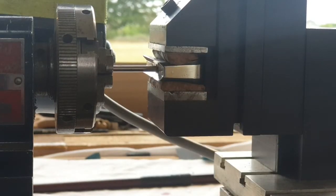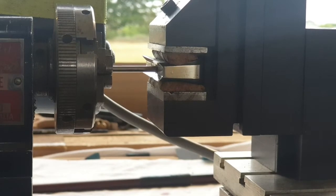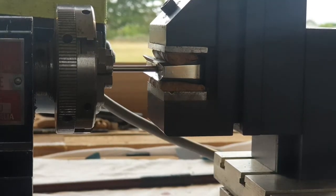Start with a 1 millimeter pilot, and then come in with our 1/8 of an inch drill. This is a thick shank eyelet in this frog. Normally I would start with a thin shank, but this frog has already got an eyelet with it that's working well, so that's a thick shank eyelet, and the pilot for that thread will be a 1/8 drill. That will be the final drill hole size. So I'll start with the pilot and then drill the final.